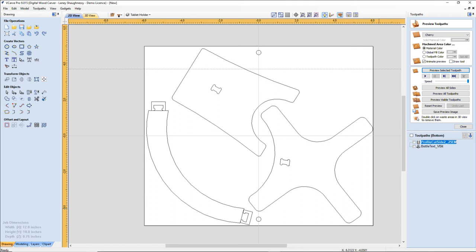All right, let's see here. You have more room in front of the tenon and the side of the dome. Now, you're also telling me to use the dog bone fillets. Well, for the mortise and tenon for this particular one, I'll have to look at that, because for this type of tenon joint it would be the T-bone fillets. But also, if I'm doing through mortises, it could be the dog bone as well. So there's two applications there. It could be either or.